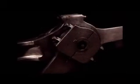This is a third set of drivers, or the main driver, because this is where all the rods connect into one. See here on the crank pin and all that, all coming together on the single axle here. This is called the main driver. That's why we changed it, because that's where all the force is going. Well, most of the force. But it transfers the force from the rods to this wheel, and there's less force going on to these wheels.